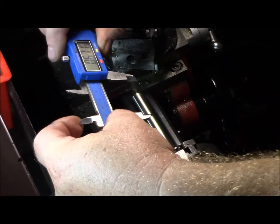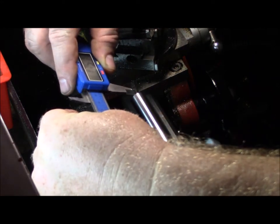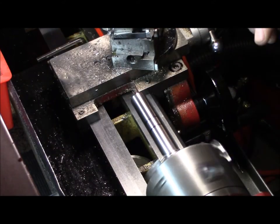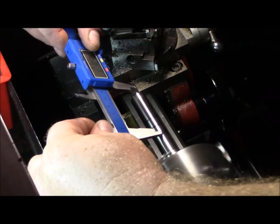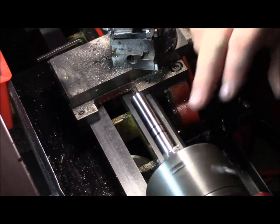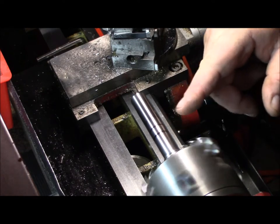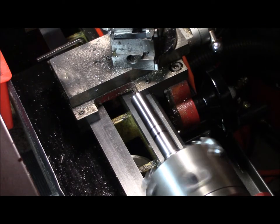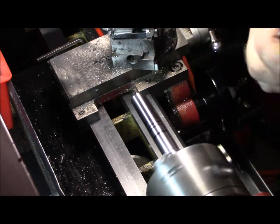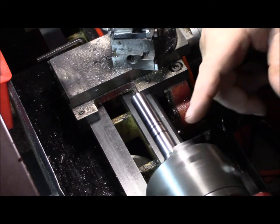What I need to do is mark off one and three-quarters and then add three-eighths to that. So one and three-quarters plus three-eighths — flip this around — there's my stop point for my quarter-inch section, and then I'll make a little collar plus a bevel. That bevel is going to start at one and five-eighths, bevel down to three-eighths right here, and then this will all be quarter-inch. I need to flip it around now.